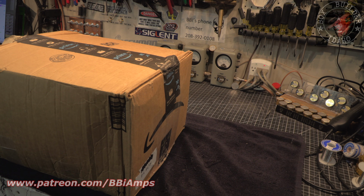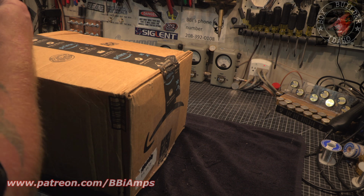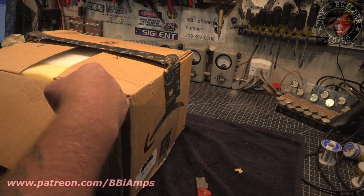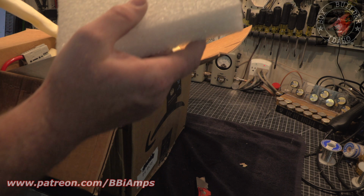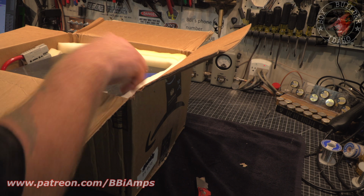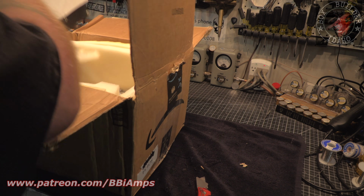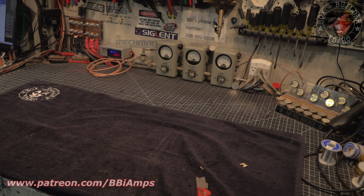Yeah, that's correct. Okay. So Dominator, Foxy, Skullcracker, all of those style of builds, Stickman, those kind of things. A few of Stickman's boxes this way. But Dominator and Foxy for sure. They had their own lengths of coax, right? So the X-Force Carl built, Dave made, Fat Boy, whatever, those coax lengths will not work with this style of box. You'll end up having high input reflect and the output is going to be way down, unfortunately. It's just the way it is. So when you're trying to compare the two, you can't. You just can't.